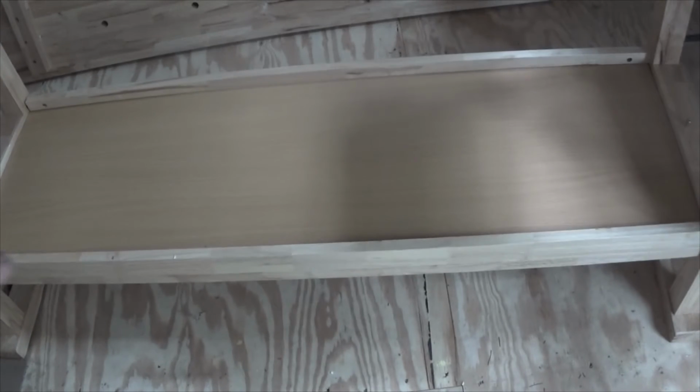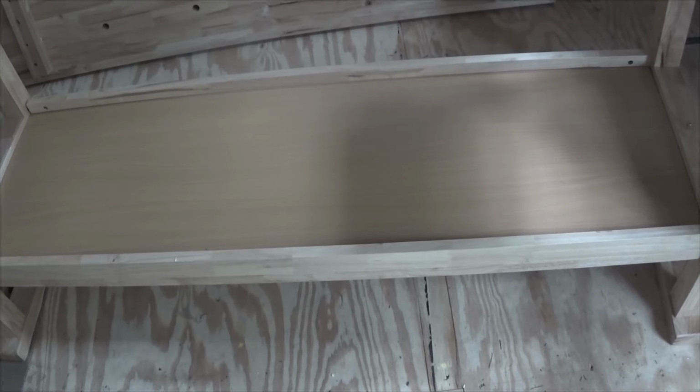In the meanwhile, I had left some slop in the deal so I could move things to get everything to fit, but I had tightened it a bit too much. So leave yourself about 1/8 of an inch of play in it, and then when you tighten it up, it'll fit exactly like it's supposed to.